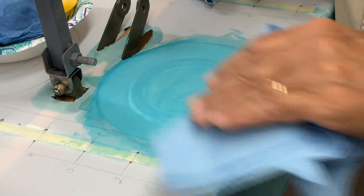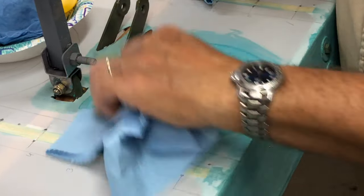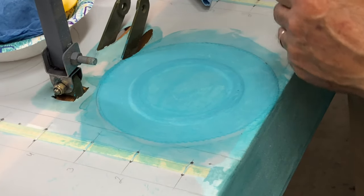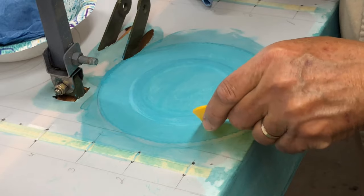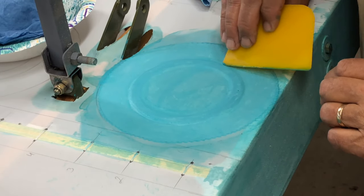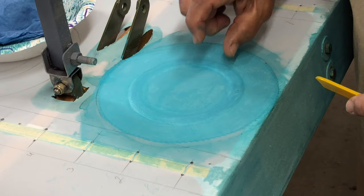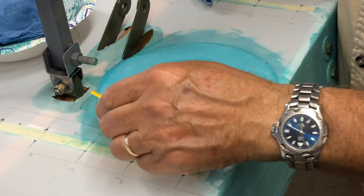Don't worry about going past the edge of your doily — you're going to be filling the weave with glue in a later step anyway, so that's not going to be any kind of an issue. These are quick wipes to get that excess glue off. I am pretty happy with that. All my edges — I've gone past all the pink edges with the glue — making sure those edges are nicely encapsulated. I'm nicely centered on my original drawn line. I can come back with my squeegee and work down any areas that need it. There are a few bubbles but I'm not going to worry about those, because in an hour or two I'll come back with the iron at about 230 degrees, and that'll be enough to soften the glue and really lock in these edges nice and sharp.